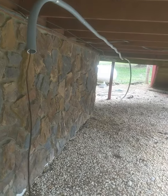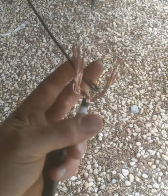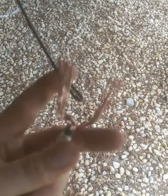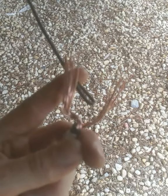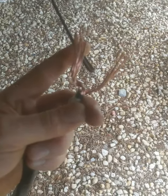We're getting ready to shove the fish stick through the one-inch conduit and pull the wire in. We pulled our fish tape through — sometimes you have to shake and jiggle the pipe; it's tougher than you think even on a straight run. Here's how to make up your wires: separate them, loop the left side around the left and the right side around the right, then pinch it down with pliers and tape it up.